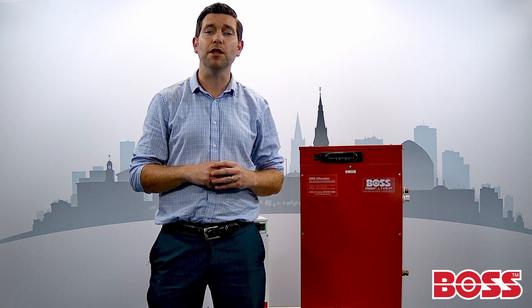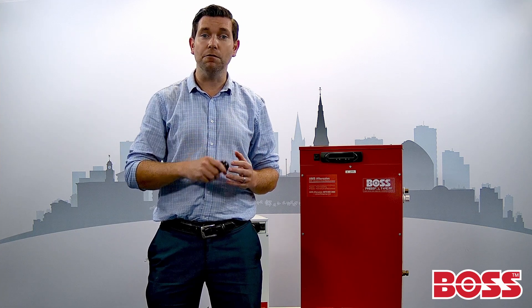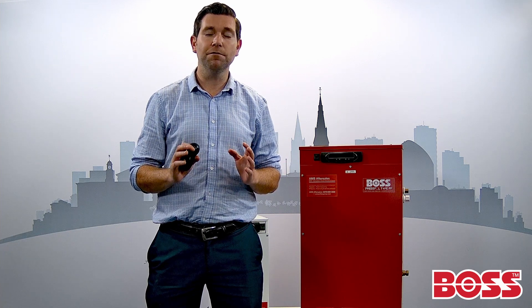The MX pressurization unit is a small, compact, wall-mounted mini unit for large domestic use above 45kW or small commercial applications, available in both single and twin pump variants. The twin pump version allows for duty standby — if one pump fails, the other will take over to maintain system pressure. It comes with an electronic pressure transducer, and the digital version has a user-friendly display.